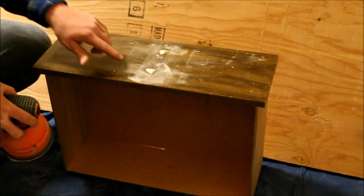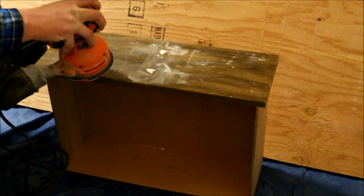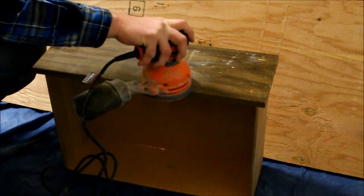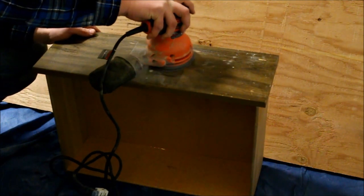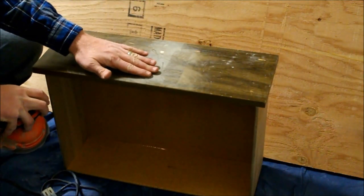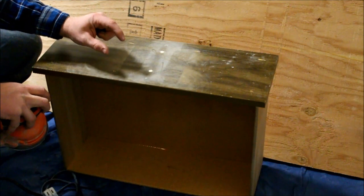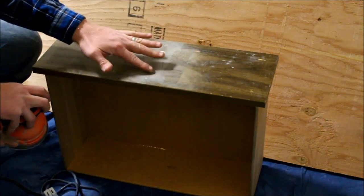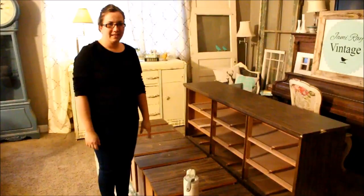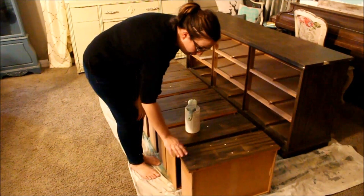We're out in the garage. We're just going to smooth the top of this off where the extra putty is so that the holes are nice and flush and you won't see them. You probably don't want to use one of those foam pad sanders because sometimes it'll dish that out. But it is nice and flush — when we paint it, you won't even see it. Our lightweight is dry and Zeb sanded over it to make it nice and smooth, and we're ready to prime.